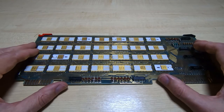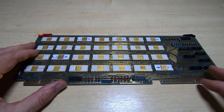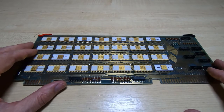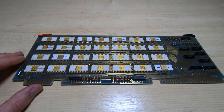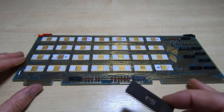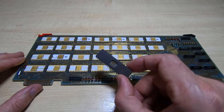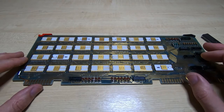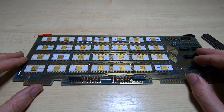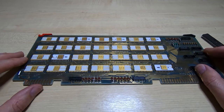There are some complications in designing a board for this. Firstly, the output from this card is merged with the output from other ROM cards, and it's done through the use of open collector drivers. So the output from this card goes onto a common bus, and on one of the cards there are some pull-up resistors on that bus, and all the cards connected to that bus use open collector outputs. With open collector outputs, the output is only ever pulled low by the buffer, and it's allowed to float for a high, relying on external pull-up resistors to bring the line back up to the high level.